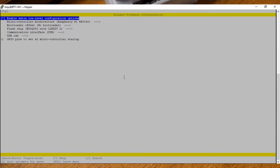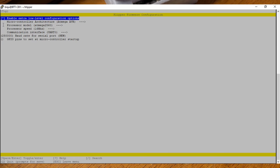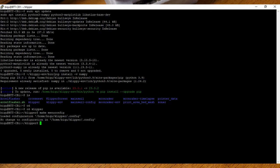If you've set up your original board, you've probably already seen this. Using the up and down arrows to navigate — you cannot use your mouse. Go to the very first option and hit space bar to enable it. Then move to microcontroller architecture, because we need to set up a different microcontroller. What is on this board is the Raspberry Pi RP2040, not the ATmega. Hit space bar to select it. Everything else is going to be default — we're using a USB interface, so you don't need to set up any special IDs. Once done, hit Q for quit, and yes to save.